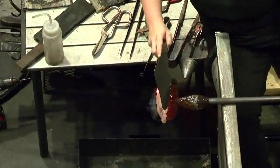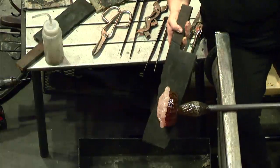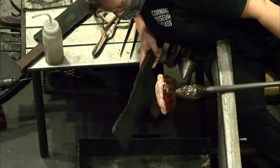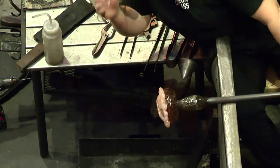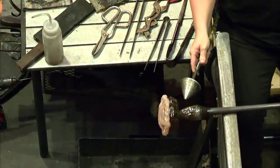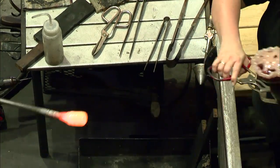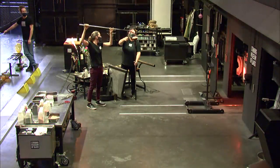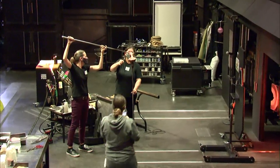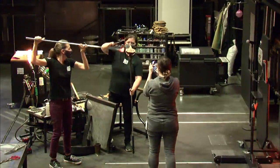That view inside of the reheating furnace is possible because we have a little window that's fused silica glass. So it's not melting in our 2,000 degree furnace. And behind it, we have a camera. And then next to that camera, we also have a fan blowing on the camera, making sure that it doesn't get too hot. So when we use that view of inside the reheating furnace, that's all because of that fused silica glass that you also use every single day.